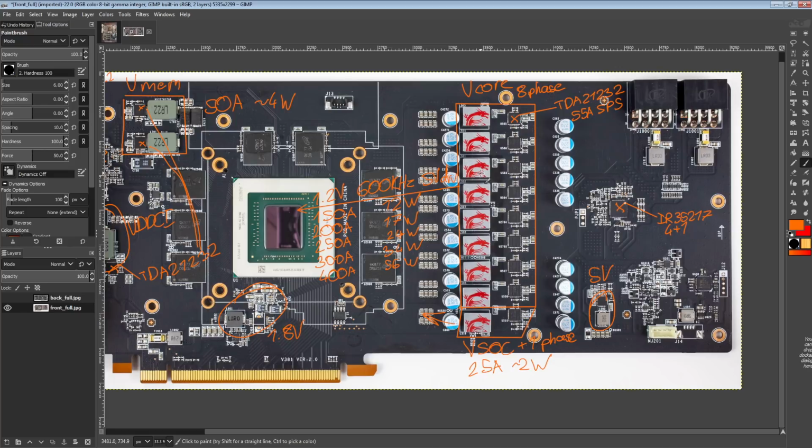What would be concerning is maybe a Strix BIOS onto a Gaming X. That might cause issues just because the VRM configuration is very different, though generally the BIOS shouldn't be configuring the voltage controller very much. It can, but it shouldn't be doing that. So yeah, even something like that should be relatively safe.